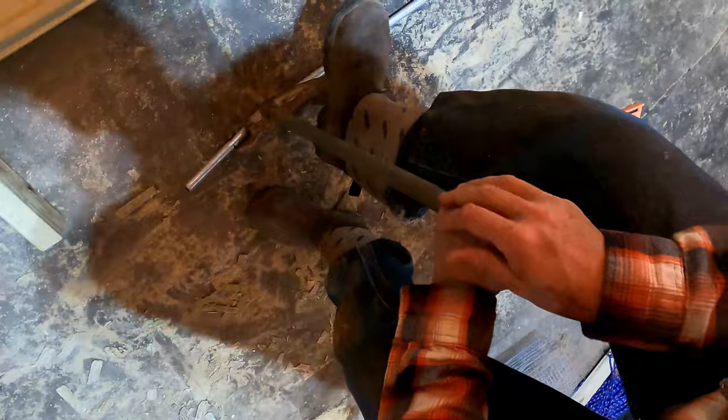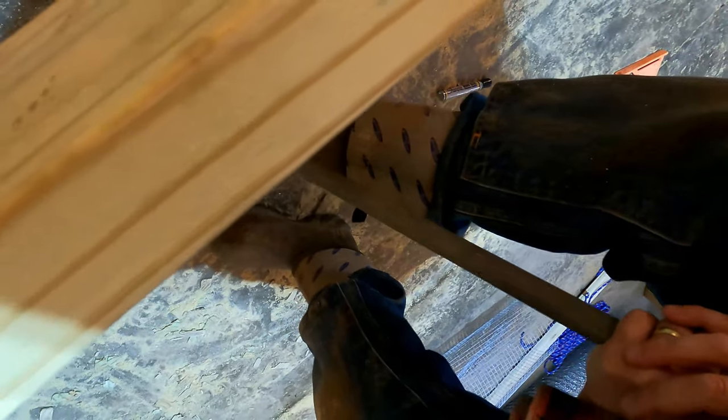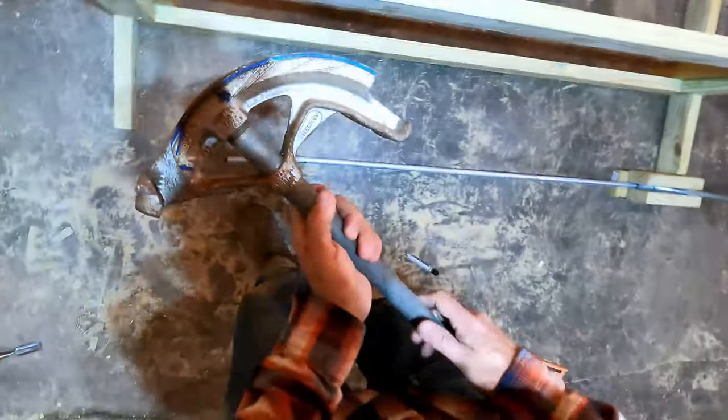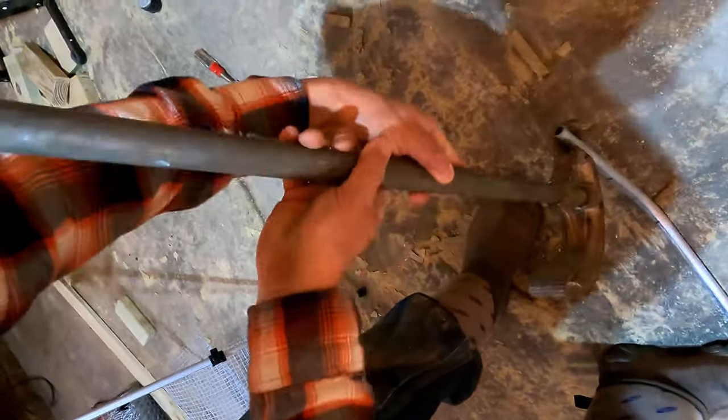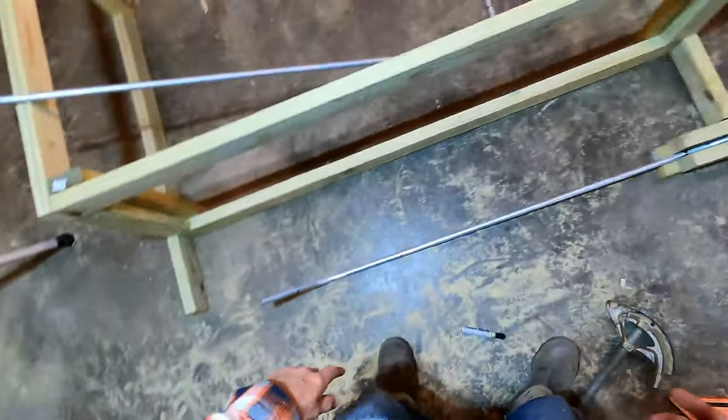And this is going to be bent at 45 degrees. So just get on the bender, bend it. There's a line on the bender, and I'll show you that here, that you bend the 45 degrees to. So here's 45 degrees right there. So just bend it until that line is parallel to the ground. Turn it around to the other end.